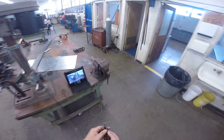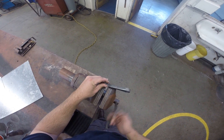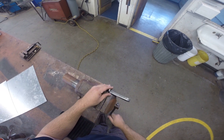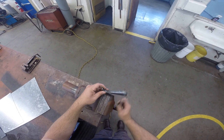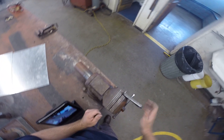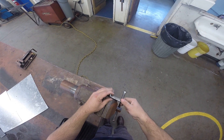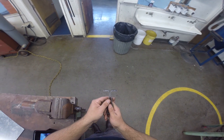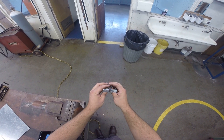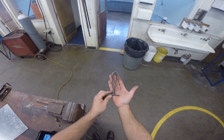If you need to fine-tune this, come right over here to a vise. Spin the vise back in, and we're going to bend the feet a little equal on both sides. If you do have a little tweak to it, just kind of force it a little bit — a little hand strength there. Basically what you'd like to see is a 180-degree angle on the feet. You have your holes already pre-drilled, so they're ready to go inside the dustpan. And that is how you make the handle for your dustpan.